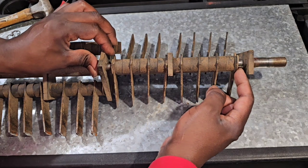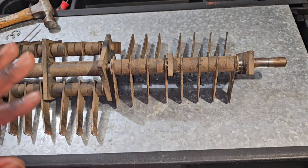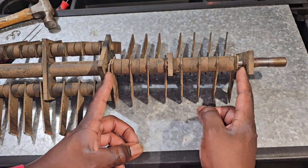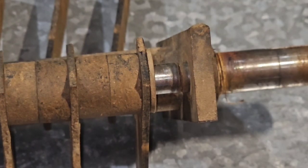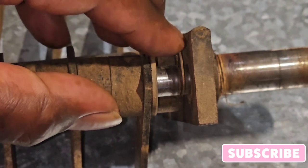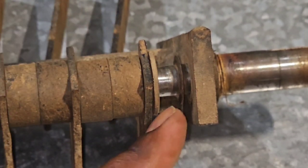Push the rod all the way through. This rod has little cut-out indentions where the e-clip sits in a groove in the rod. The e-clips go on the inside — they can only go on the inside, not the outside; the rod isn't long enough. Put your e-clip in the slot, then take a pair of pliers, put them right up under and on top of it and just push down. See that — it's in there.